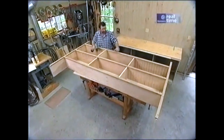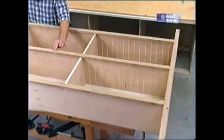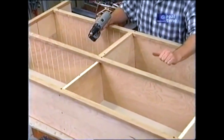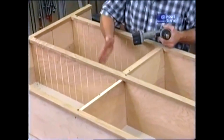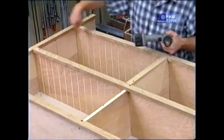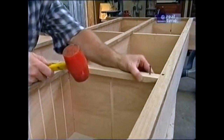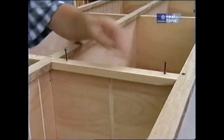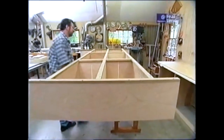With the case flipped over, I've been working on the front side installing a face frame. I'm using some hardwood — oak pieces I had around the shop, though it could be cherry or ash — something strong enough to reinforce the front edge of the shelves, giving them some stiffness. These pieces also cover the exposed plywood edges and hold my partitions in place. I have to make a provision to remove these pieces, that's why I'm using screws, so that I can reconfigure my openings. There's no effort to reinforce the joints — they're just butt joints — that way it's easier to take apart.